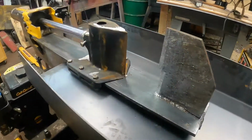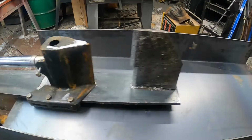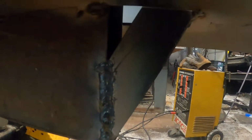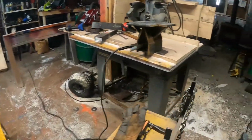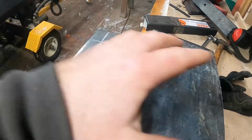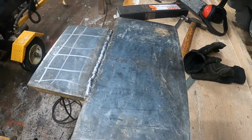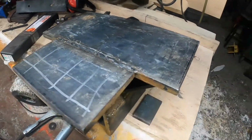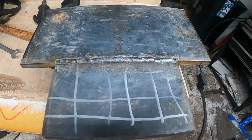So I have to replace this bolt that broke, and got the brace welded on right there, so that back of that wedge shouldn't go anywhere now. So the final step is to put my padded weld on this. When the pieces are up, they'd like to jump off of it. That'll prevent that, because there were a couple times a couple pieces jumped off of that, and if that would have hit me in the leg or something, that'd really hurt somebody.